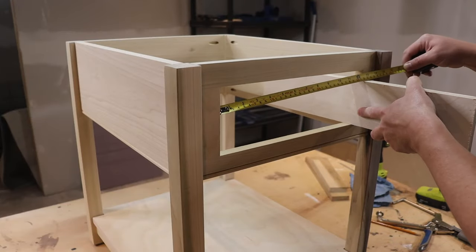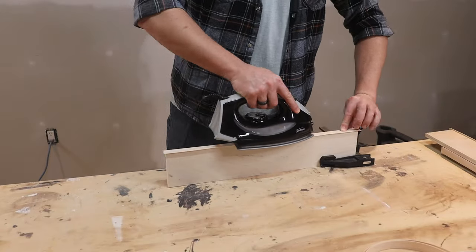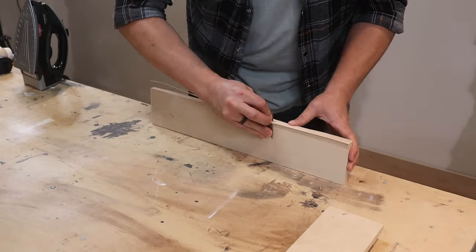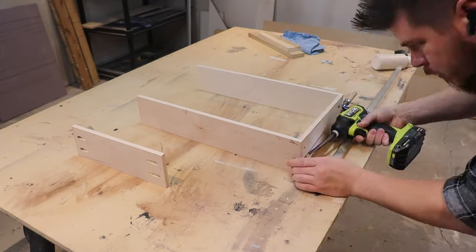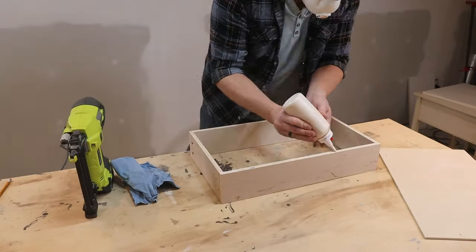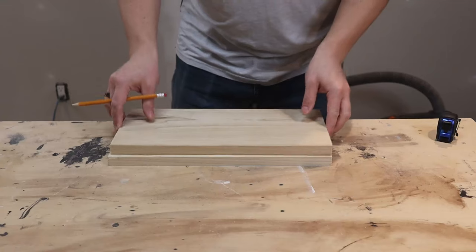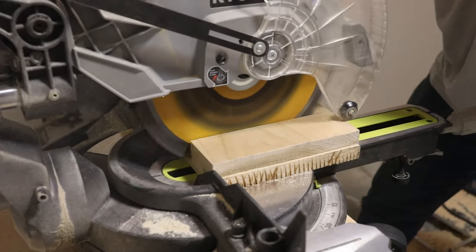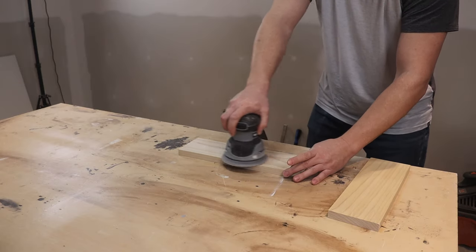For the drawers, I didn't need anything super heavy duty so half-inch birch plywood is the name of the game — that's going to be plenty. All the same pocket hole drawer methods apply and I've got a complete dedicated video on my channel if you want more depth on how to size, cut, mount, and install drawers like this. For the drawer fronts, I used more solid poplar stock cut a quarter inch smaller in both directions to leave a perfect reveal, then sanded them smooth.